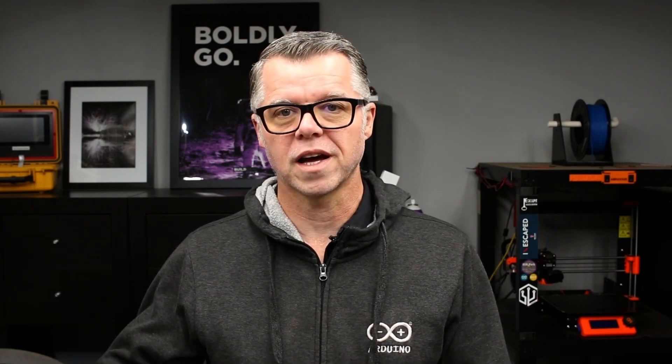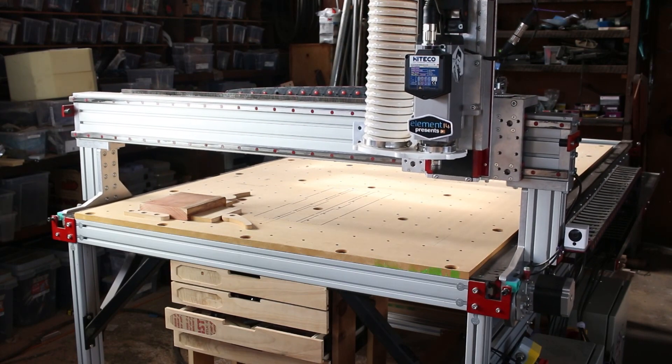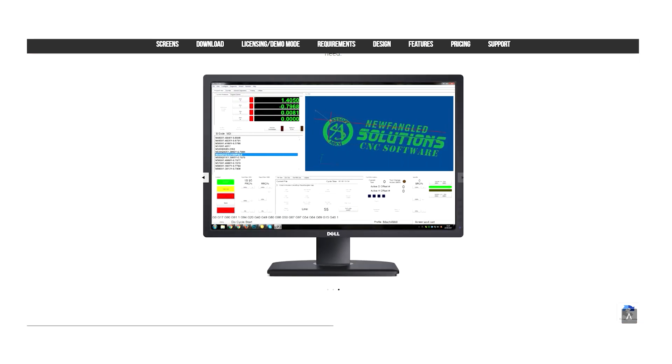The original plan was to build a handheld pendant that I could connect to the control computer via USB or something like that. I could then carry that over to the CNC machine and have all my capabilities for jogging right there. I also wanted to add some information readout on the pendant itself. Mach 4 comes with a bunch of different plugins and I started looking through them to see which one would allow me to do bi-directional communication. I started working with the Lua plugin because I could write software and just do that.